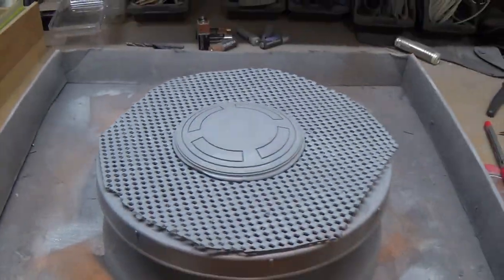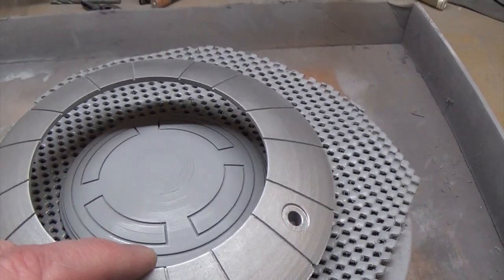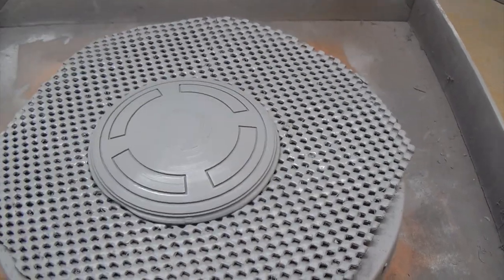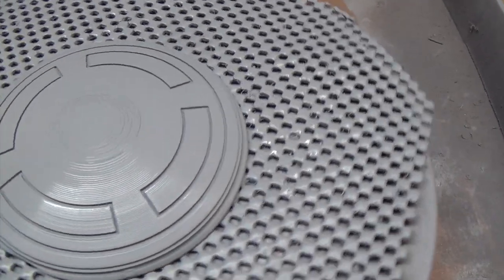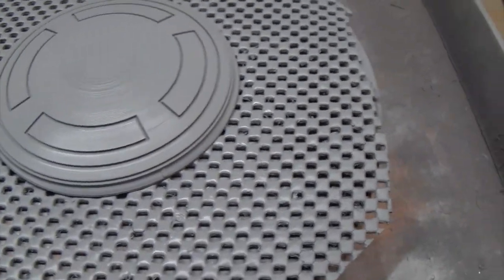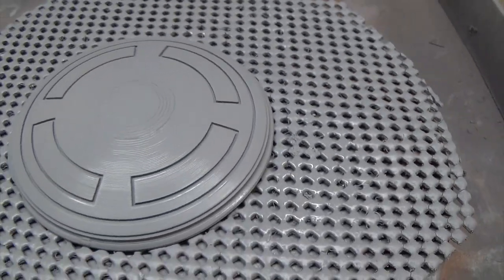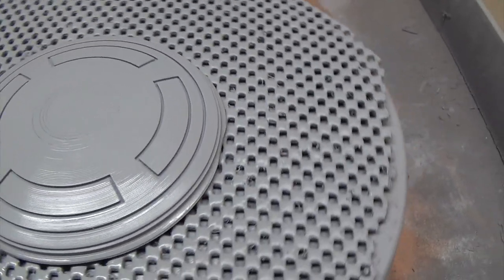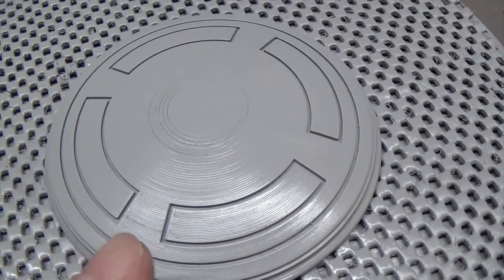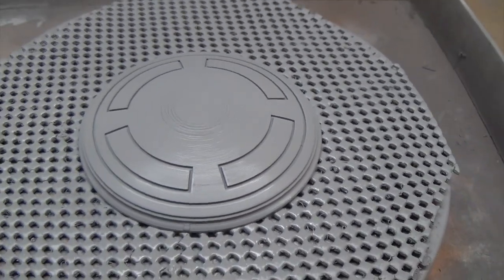This is the other part that I've 3D printed today - this was printed in one piece. It's the bit that goes in the middle of that. I'm not going to lay it on there at the moment because the primer is still wet. I'm just priming it and sanding it to hide the rings a little bit, because you do see the rings in a 3D print. I'm just building it up with primer, sanding it off, building it up, sanding it off until it's not too noticeable. There's no way I could mark out and etch those lines that accurately without doing it this way.